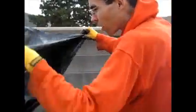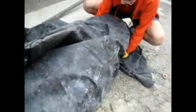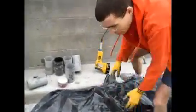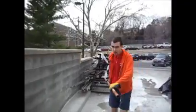It doesn't need to be perfect, but this is pretty good. Take a tarp or white burlap and cover your beam. Also, before you put concrete in the beam, make sure you haven't left it somewhere where it's blocking a pathway. Tuck your plastic or burlap underneath. Take a scrap piece of steel or plywood or whatever, and angle it across so it doesn't get blown away. Your cylinders should be labeled, filled, and stored near the beam.